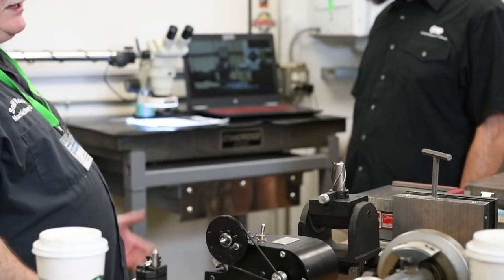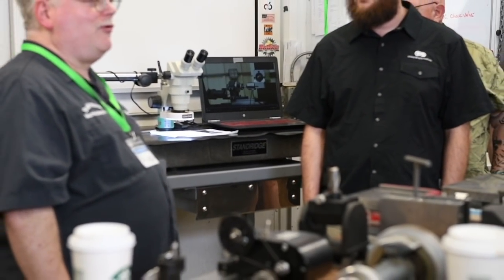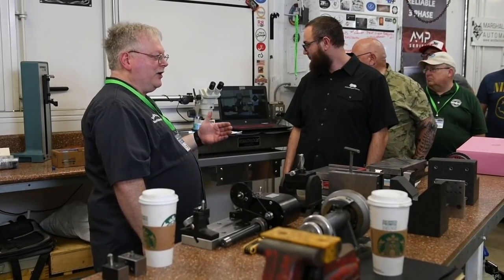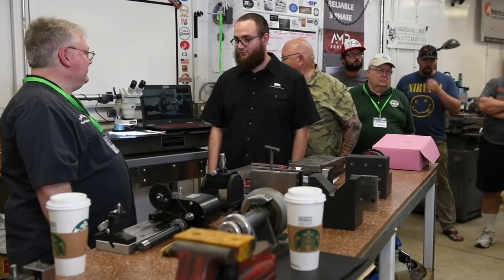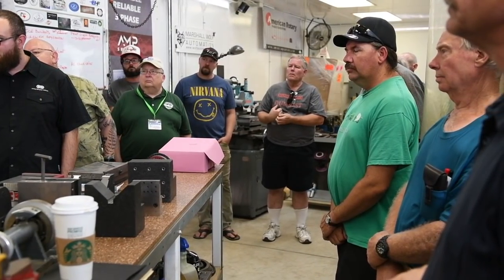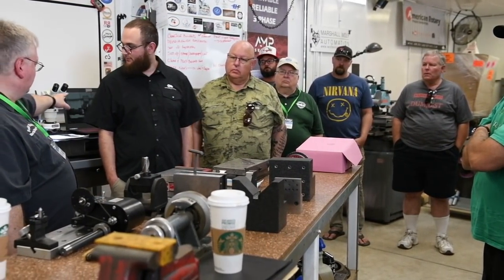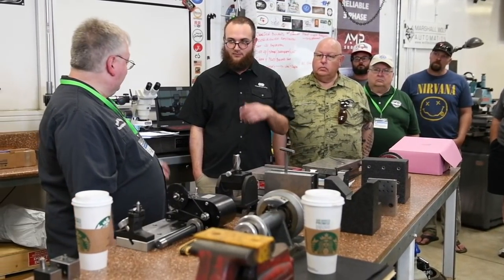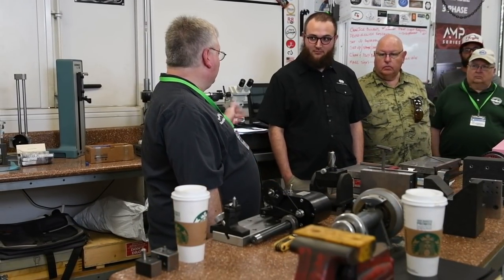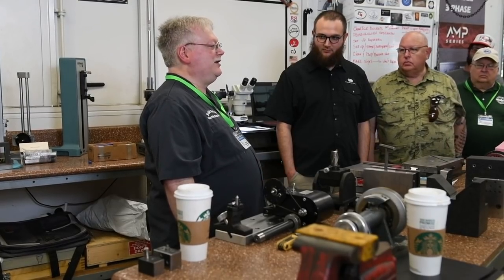There's a company that makes a very precision alternate unit. I've used them over the years - in fact, I did so much of it that when they'd start wearing, I'd pull them back and rebuild them. I got it down to about four hours. But when me and Adam started, that was close enough. Most everything we were doing was motorized. Your support tooling for the surface grinder - you've got a spin fixture, you've got an air turbine. I made mine so you can do OD grinding, ID grinding, and surface grinding all on one machine without a huge investment.